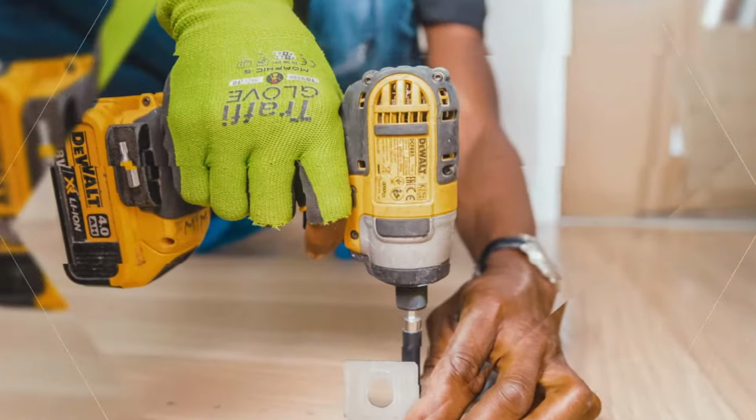Now the way you get it set in the hole is by using something called a setting tool. So once you drop it in the hole, let's pretend that's in the hole. You take your setting tool, which is this, it's just a solid piece of steel, and you put it in the opening there, and you take a hammer and hit the top of this until this portion of the anchor expands. You see that it has these slots around it. That allows it to expand and anchor itself into the hole. Then once it's set, you can take its mate, this bolt right here, and put it in the threads. Tighten it down with a wrench or a power tool with a socket on it, and it fastens itself to the concrete. A lot of times, these anchors are used to suspend sprinkler systems, HVAC systems, and stuff like that.